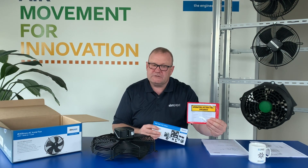In summary today, I've talked to you briefly about the ThisFan catalogue, the importance of the operating and safety instructions which are attached to every skid and inside every box. I've also gone through the application of evaporators and the use of fans in that application, as well as shown you both AC and EC products available broadly across the market for evaporators.